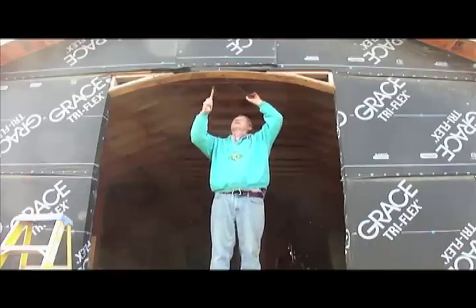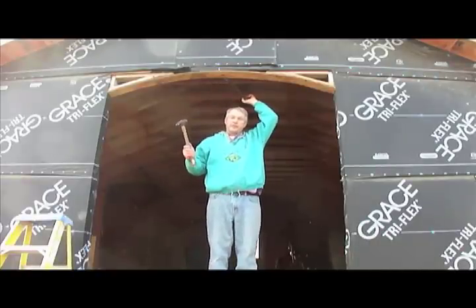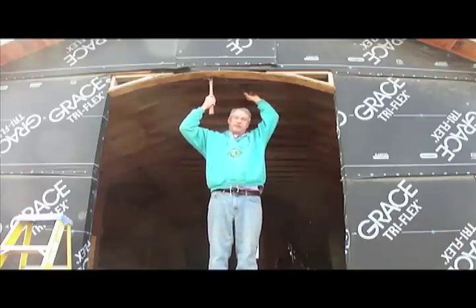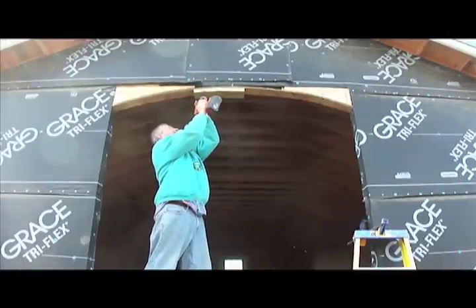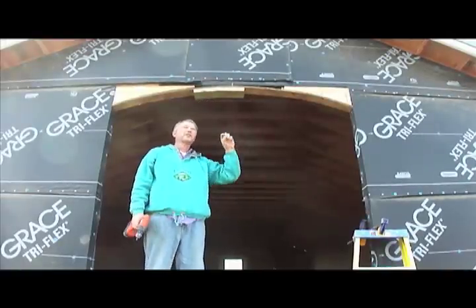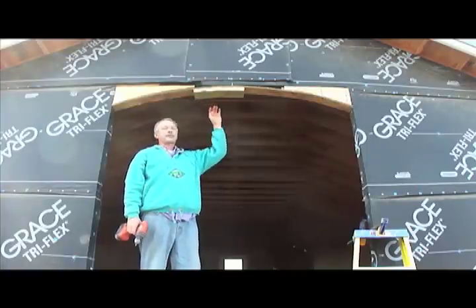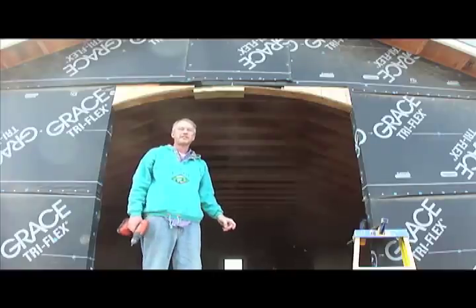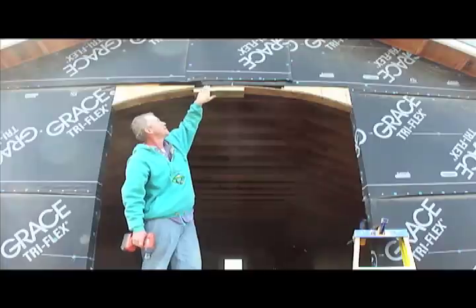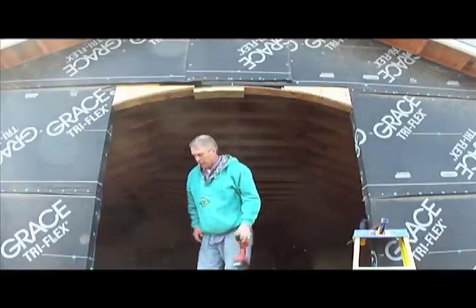When you see that something's not right, it's usually easier to redo it than to work around it forever. And good curves are hard to come by. So I'm using a little bit of liquid nails and a biscuit joint in each one of these. I've done several of these kind of openings, and this is the first time I've ever used an OSB for a guide, but it's handy to have something to make sure each one is flush. And we just work our way around the curve.